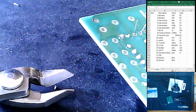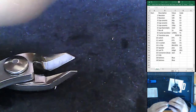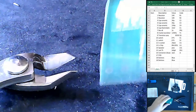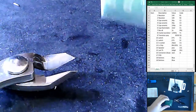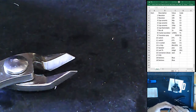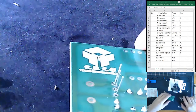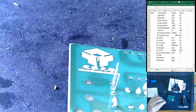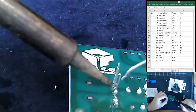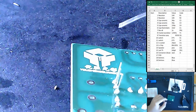If you imagine I told you to wait for like 5 minutes, right? And you have a clock, and the clock tells you exactly when 5 minutes is and it's all good. You wait 5 minutes and you move on. But if your clock were to break, would you just stay in the place for eternity? No, you'd know time has passed. I'm going to move on with the rest of my life, or I can approximate how long 5 minutes is. Computers can't. They need to be told every single step, and so that's what we use the crystal oscillator for. It's telling it to do the next command, do the next thing, and it's telling it to do that at 12 million times a second.